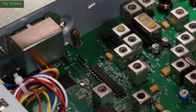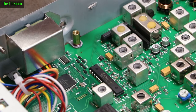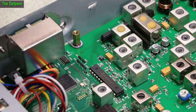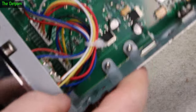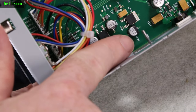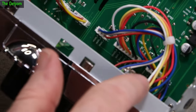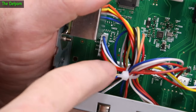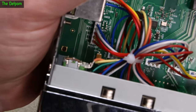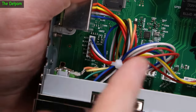I'm going to solder a little wire lead to this metal can so it has a decent ground. Then I've got to hook up a VCC, which is supposed to be 5 volts — a bit tricky to find. I have found a VCC supply over here on U701 — where C704 and C705 are, that's a 5 volt measurement right there. It comes around the chassis, goes through a wire, pops back up where that tantalum capacitor is at C706, and comes up to the second pin of that connector on the yellow wire. So there is a 5 volt supply right there. There is something I can use, though I'm not quite sure of the best place to hook up to yet.